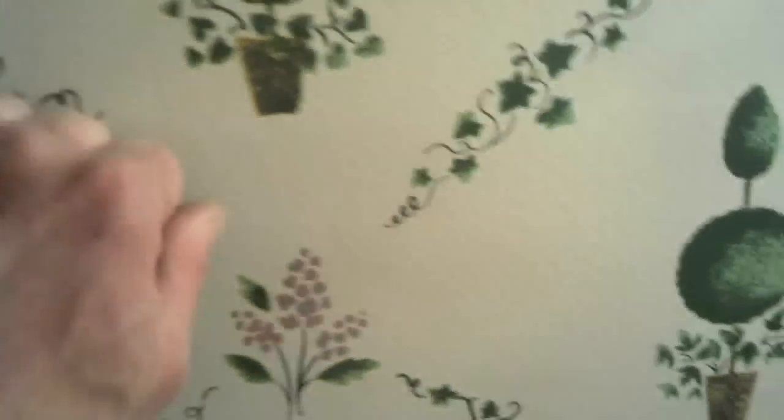Be careful — masking tape on wallpaper can peel it off. Important thing: placement. We've got a toilet over here, so this bar is going to help get up and down. We're looking for a stud — there's a lot of sheetrock here. I figured this spot is best; putting a handle over in the catty corner near the shower would really get in the way. So think ahead and figure everything out before you start drilling.